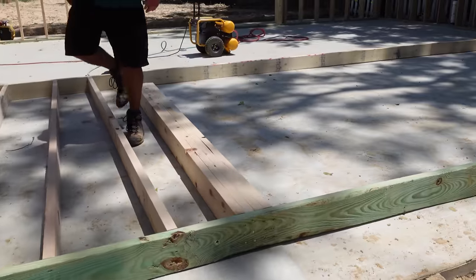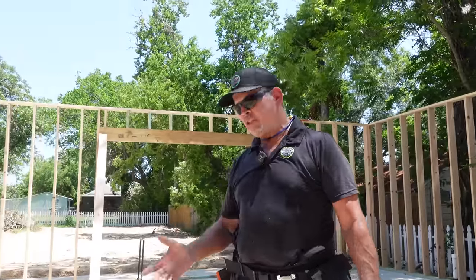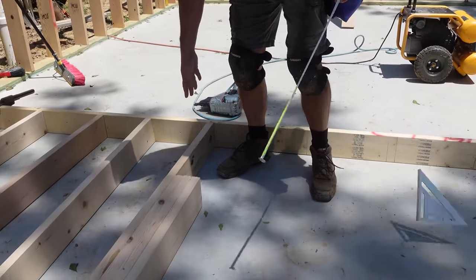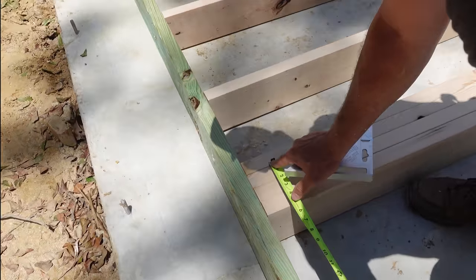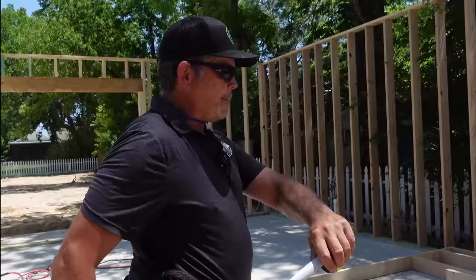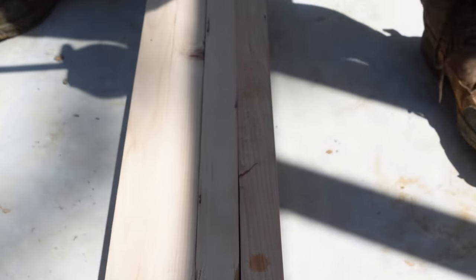The wall is all assembled and now it's beam time. How do we measure for that beam? We could measure up here but what if the wall has a little bow in it? It's always more accurate to measure at your sill plate or base plate. I'll have Rad hold the tape against one king while I pull a number to the other king — that's the length of our beam. 226 inches — let's go cut it.